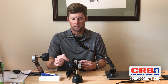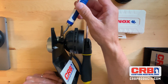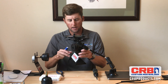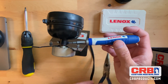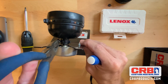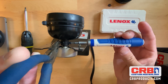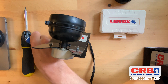On the backside of this chuck — this is your RDS standard rubber chuck — you've got a nylon locking nut. And on this side, you have an Allen key head. So what we're going to do is use the Allen key head. I'm going to turn it on its side, put the Allen key in, grab the nut with the needle nose pliers, and then back off with the Allen key. Your nut will come off — put this nut aside because we will reuse this hardware.